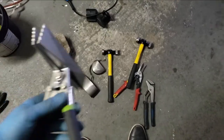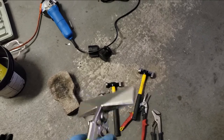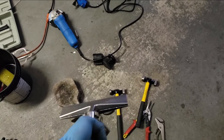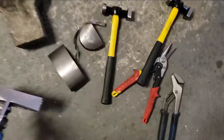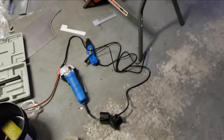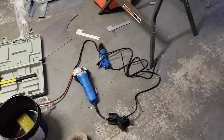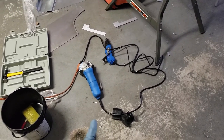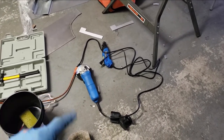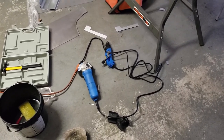These are the tools I've been using. This is a seamer to create straight bends — it's actually more for straightening metal, but I got it to create the bends. I used a whole bunch of dollies and hammers and just whacked away at it. Cutting with the angle grinder — that thing is amazing. You can't do metal fabbing without it, that's for sure. I've also been using my Dremel to cut the small areas I can't get to with the angle grinder.